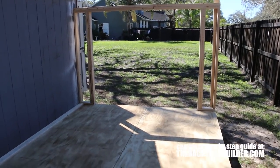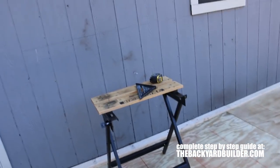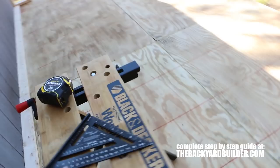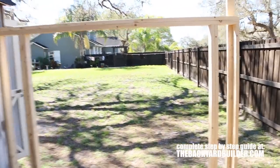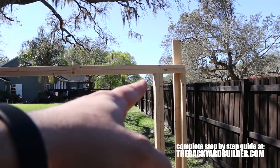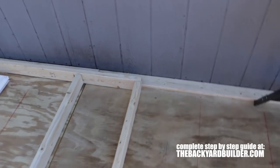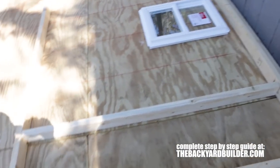Welcome back to framing day. I just swept the work surface and I've got my little Black and Decker Workmate — I love it for putting all your stuff up at hand height. I'm going to start the framing process here. I got a wall done yesterday — it's not complete, I stopped at a corner post — but this wall is ready to go. This is where the six-foot double door is going to go, and that's going to be my lowest point which is the double header.